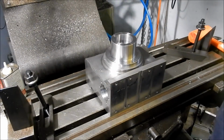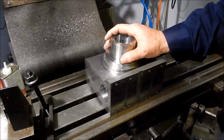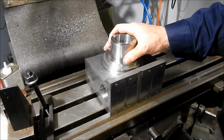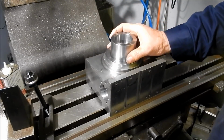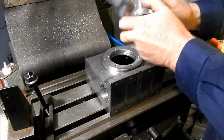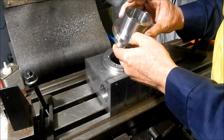It makes it so much easier for fitters, particularly if it's in very, very awkward spots, to access gear, to take it apart and work on it. If it's machined all as one item, which often you'll find the stuff is, trying to set stuff in situ can be an absolute pain. So if you go for the cartridge design, which is what I love, it breaks it down and makes it so much easier for the fitment. Alright, so we'll get set up and we'll get ready to do these holes.